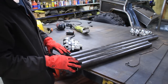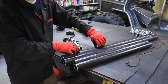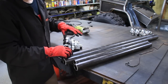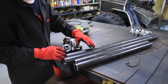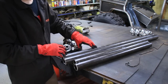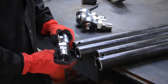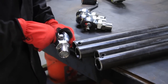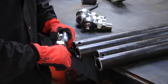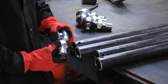Now we're going to take these bungs and put them on here and weld them up, same for the other side. These bungs from TMR Customs are pretty cool — they've got a hex head on them, which helps because you can put a wrench on it and tighten it a lot easier. Most bungs just come rounded and you have to try to hold onto the tube while you tighten up the jam nut. But with this, you can have two wrenches on there and get it good and snug.